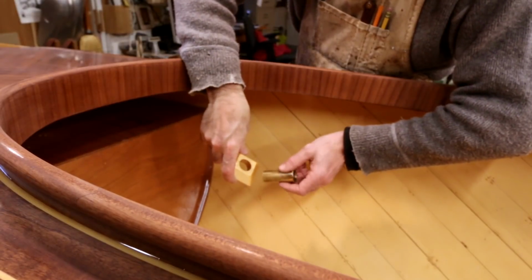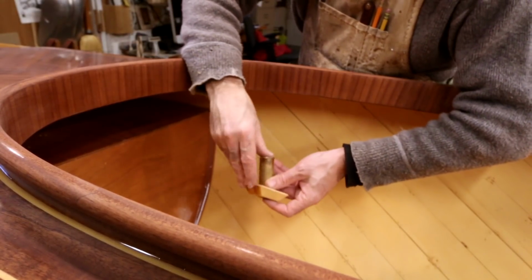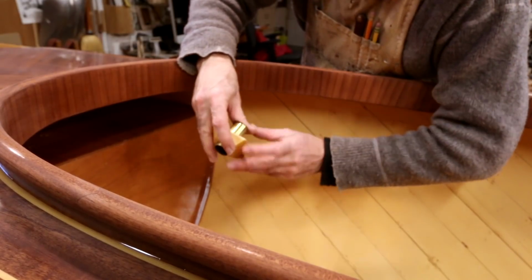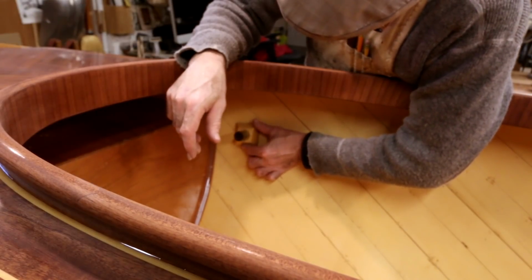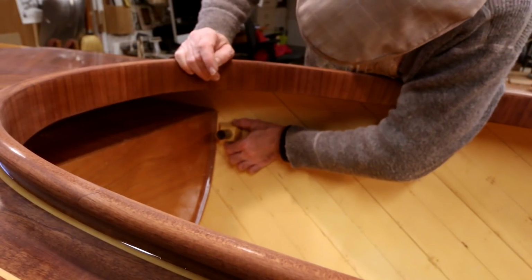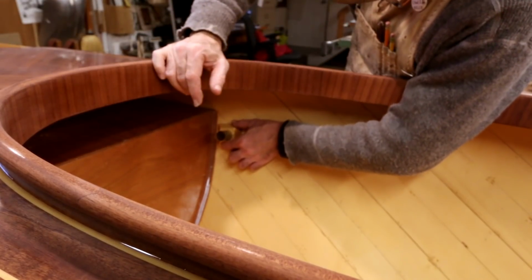I've made this little wooden fairing block. That's just going to give this more meat, because I don't want to have this tube resting on just the planking itself. So I want to beef that up. So that's going to slip through from the outside. It'll be basically like this. It'll give us a nice bit of meat to drop a hose onto